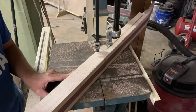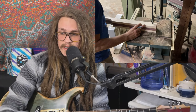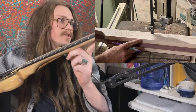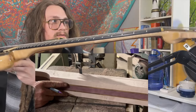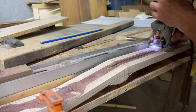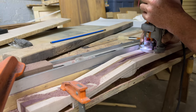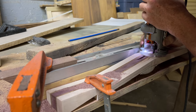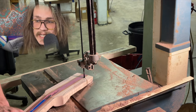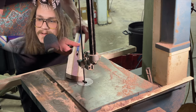This is the neck break angle that Greg's doing right now. The neck goes at an angle from the body — sometimes when you're doing a neck-through it's easier to achieve that by taking it out of the body section. Now here we are routing out the truss rod channel. Greg went through and cleaned it up, because if you mess up the truss rod routing you have to restart — or you can fill it and try again, but then you're compromising the wood. That was just the cleanup pass. Now that we've got the neck break angle, I'm now on the saw — I'm cutting out the headstock of Birdie, which is my favorite thing. I love this headstock design that I came up with.